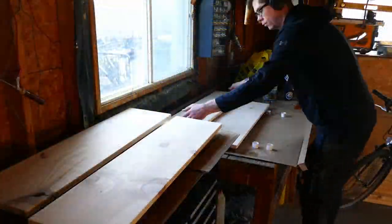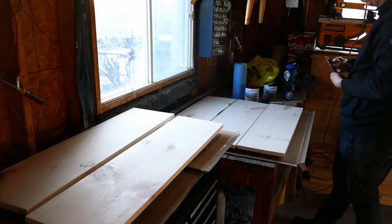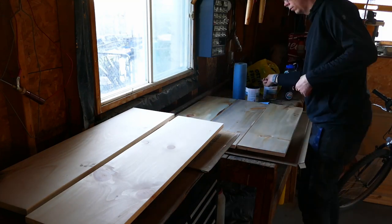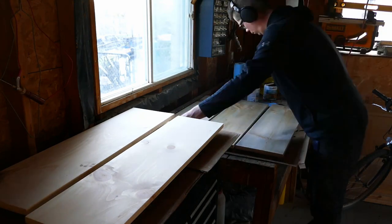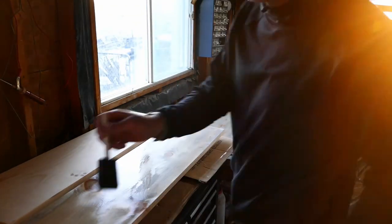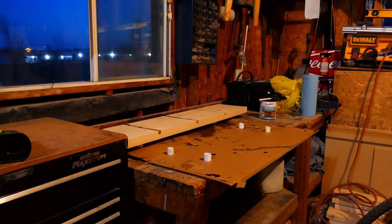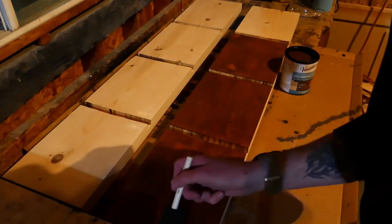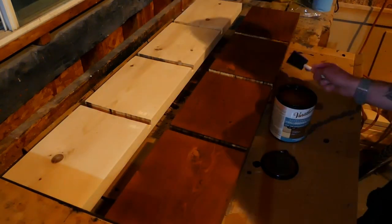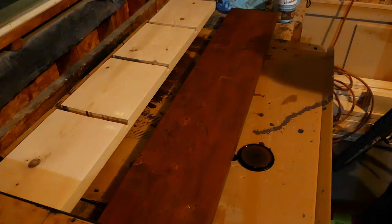I put some of Varathane's weathered wood accelerator on the shelves. I wanted something more rustic and not pine-looking, and it ended up working really well. I applied one coat and it came out light grey, so after the glue-up I decided to add a second coat — I should have done it right after the first one, but lessons learned. I coated the top, bottom, and all the edges, since coating only one side can cause warping. I used cardboard circles cut from a mac-and-cheese box to elevate the wood with minimal contact, but I forgot cardboard is quite absorbent and it was a water-based stain, so it soaked up some stain leaving lighter-coloured circles, leading me to apply that second coat right after the glue-up.